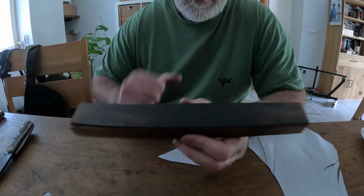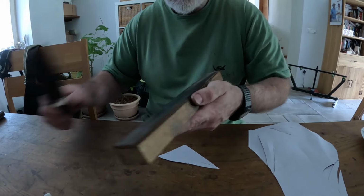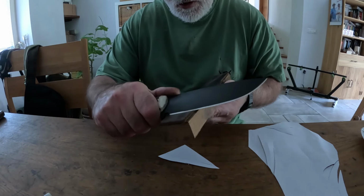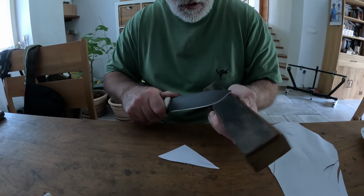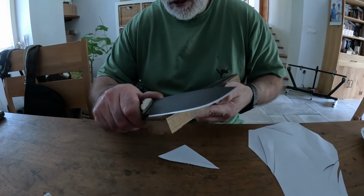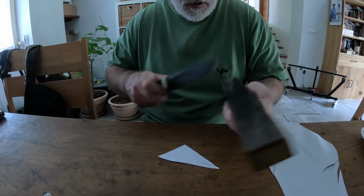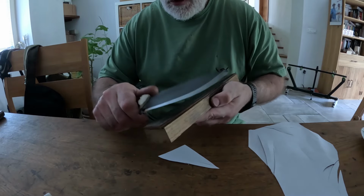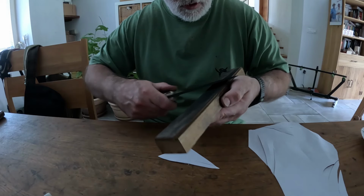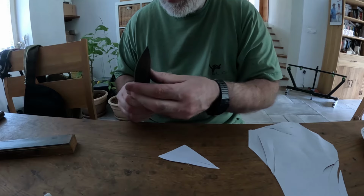So now here, again, a belt, a waist belt for your pants, glued on some flat wood, and just finalize. You will feel it sticking, which means you still have to go on, a simple way of understanding where you are in the process of refining the edge. Sometimes I will note that I didn't go good enough with the 240, so I might also return down to the workshop, to the grinder, or go back to the ceramic rod.